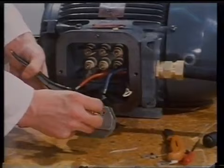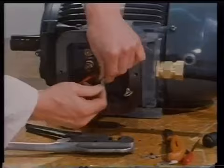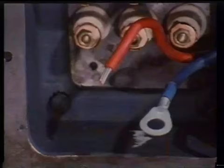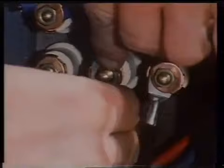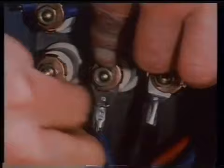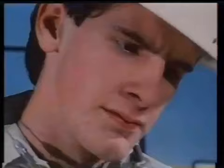Now the conductor ends are fitted into crimped lugs and the cable connected to the terminals. Check that the lugs hold the cable tight so that they will not vibrate loose when the motor is operating. Nuts are tightened sufficiently to avoid becoming loose due to vibration.